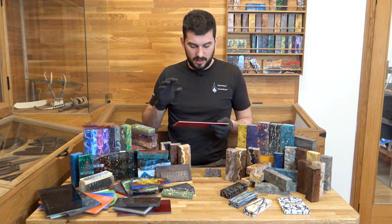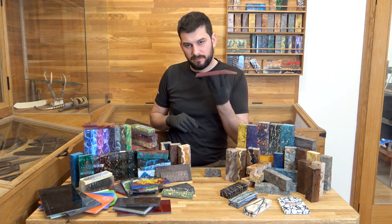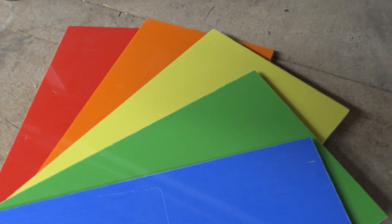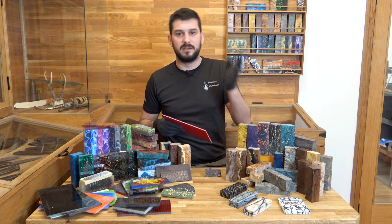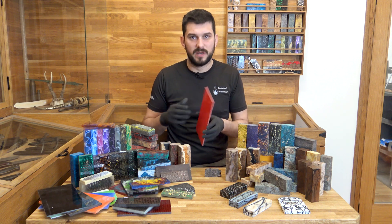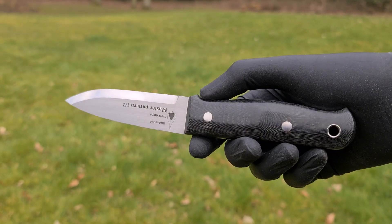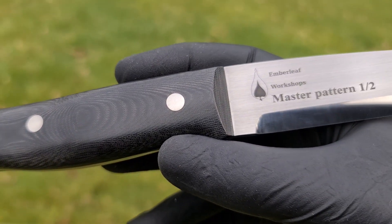The next type of synthetic we have are phenolic fiber resins. There's G10, which is basically a lattice of fibreglass — very, very hard wearing, not as shiny, comes in matte block colours, but really good for grip and texture. There's also micarta, which comes in three different types: paper, linen, and jute. They are very, very tough materials. Micarta and G10 are the most stable materials you can put on a knife — they have the best working range in terms of heat and cold and will never move or shift. Black linen micarta is actually what we use on the Raymears bushcraft knives. It is laminated layers of linen with an epoxy resin, making it very hard and very durable, but it gives a nice natural vibe when abraded in the right way.